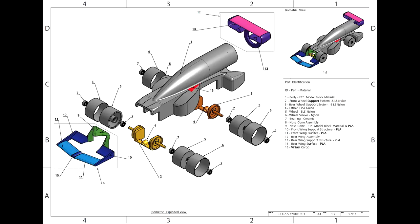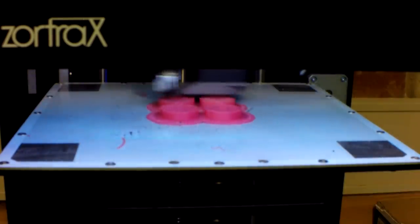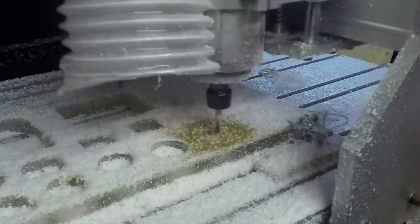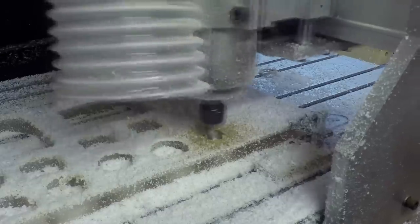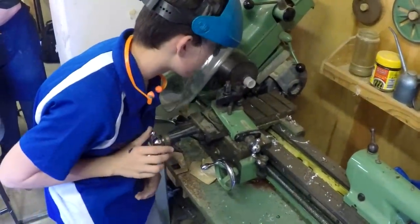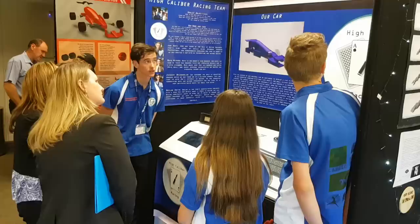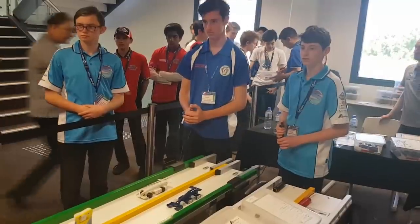One of the biggest changes was the need to design and manufacture your own multi-part wheels. Various teams tried various methods over the years, including 3D printing. These were convenient, but had visible layer lines and weren't perfectly accurate. Another team experimented with milling the wheels out of 15mm thick acrylic, but towards the end of the job the acrylic got quite hot and lost dimensional accuracy from warping. This required some attention on the lathe, but we still weren't able to get them exactly where we needed them. We were able to finish and race the cars, and scored well in most elements, but wheel inaccuracy tended to remain a challenge.